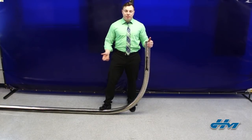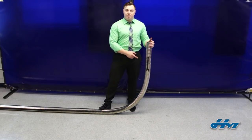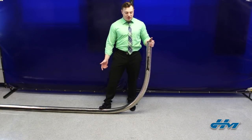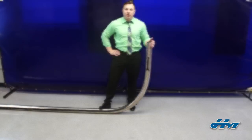The first and simplest step is a visual inspection. All manufacturers can provide what's called either a flow arrow or a lay line painted on the outside of the hose. It's always going to be straight when it leaves the factory. So if you look at your hose and it starts to look like a candy cane or a barber pole down the length, you know the hose has seen some torque.